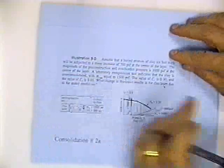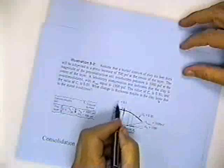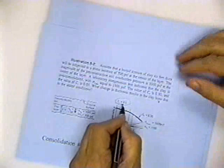He explains this in pretty good detail in your book, and we're running out of time. So I think you can work through this example problem. It is not in your book, but there is an example problem somewhat similar to it in the book. I just gave you another one because this gives people some difficulty. It's worked out in detail, and you can work it, and you can work the example in the book. But what you've got there is two coefficients. You've got one for the soil that is already consolidated for a load up to 1,000 pounds or close to it, so the slope is real flat. So when you calculate this total settlement, this coefficient is smaller, and then you get into the steeper part of the curve, and you calculate the consolidation in parts.